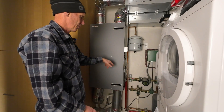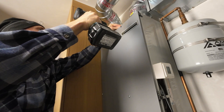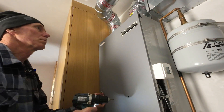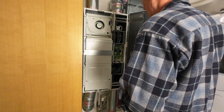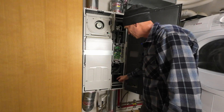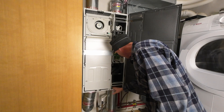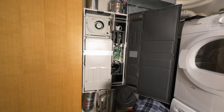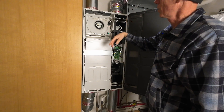So I'm going to crack this thing open with the power off and we'll take a look inside. With those six screws out, I can just open it up. You can see in my case — and it depends — it can be mounted sort of upside down or right side up depending on your installer. But this is where the cool air is coming in from outside. This isn't as bad as it's been in the past. I'll bring the vacuum up and vacuum this out and check the route to make sure it's not obstructed — and this actually looks pretty good.